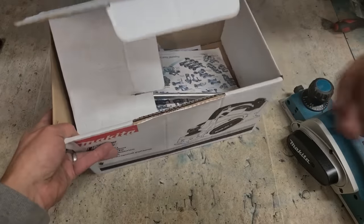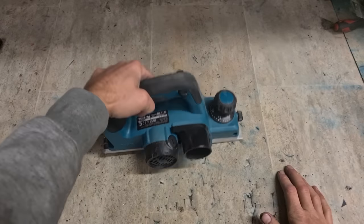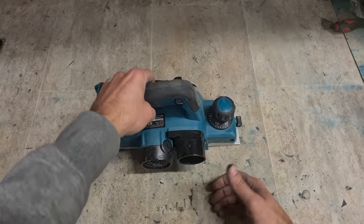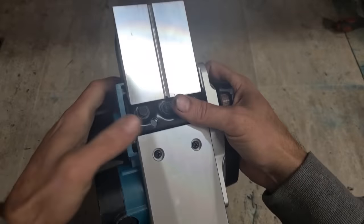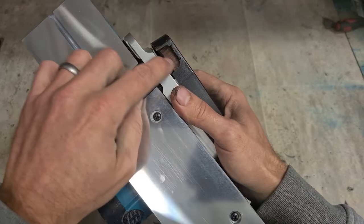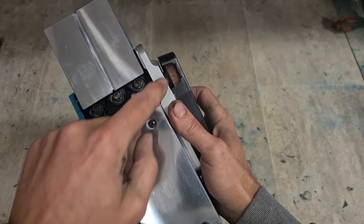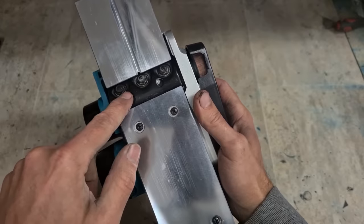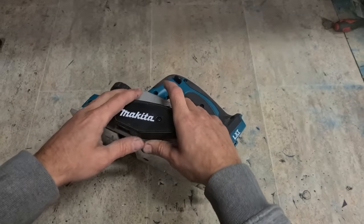This is a bit of an odd one. Didn't care that it's been used, didn't care there's sawdust in the box or anything. Problem is, she doesn't work. Totally jammed. Hear that spindle there? You can see the cover's pushed out. This here wee pulley spindle is actually threaded onto this drum shaft. It is unthreaded. Pinned itself against the cover.